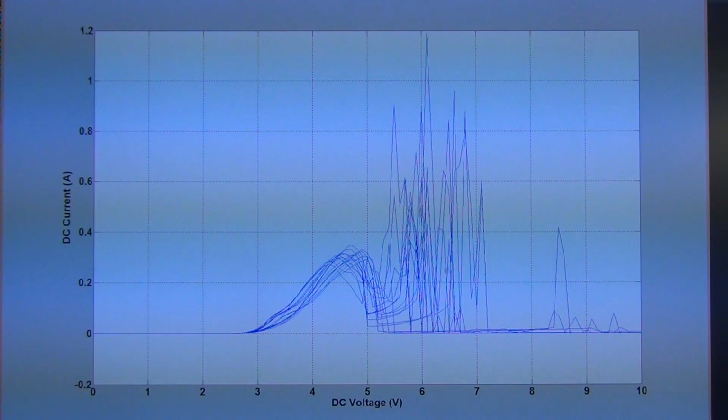Now we should also keep in mind that this behavior will depend on how fast we raise the voltage, so it's going to have some correlation to the step size between the points of the sweep. But of course I'm only comparing them together, so I'm only interested in the relative difference, and you can see some consistent behavior. A study like this on an LED is interesting, but it can be very helpful when you want to characterize or qualify a particular device or IC, or even something more complicated where you want to study what type of failure mechanisms you can have.